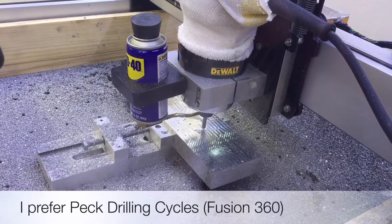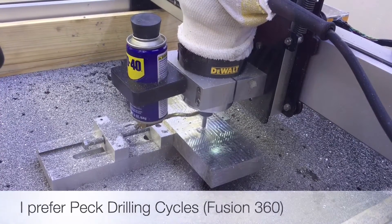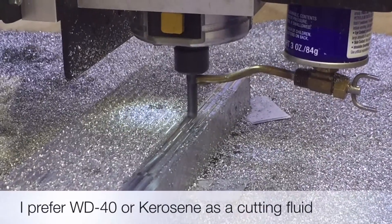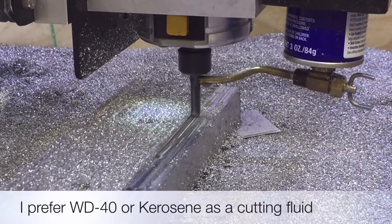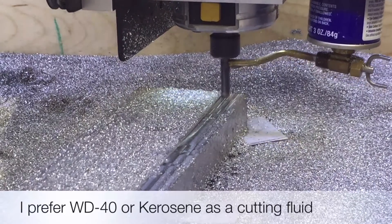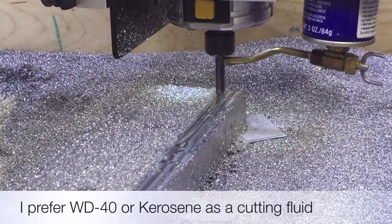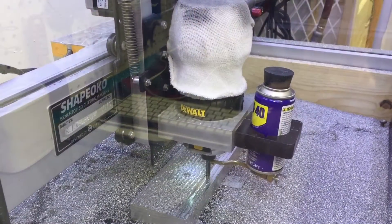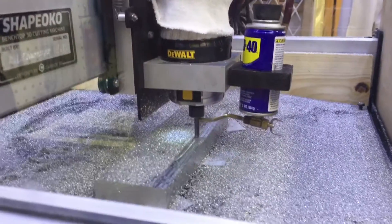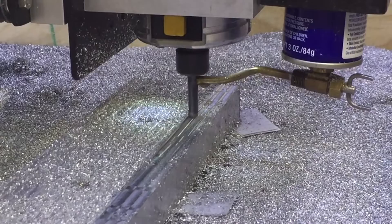During manufacturing, I prefer to drill my aluminum. Unfortunately, Carbide Create doesn't have a drilling program. You can try using a pocketing program, but it doesn't usually work when you need a quarter-inch hole with a quarter-inch endmill — it doesn't create code. So I use Fusion 360 with a full-retract peck cycle. Very simple to use, and there are helpful tutorials out there. Remember, you're going to crawl, walk, and then run — don't worry about peck cycles until after you've mastered a dozen aluminum parts.